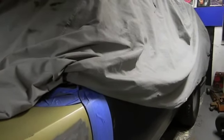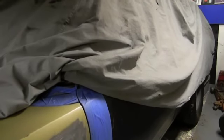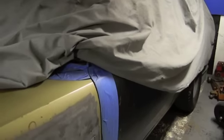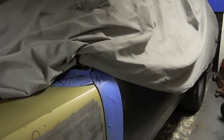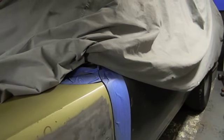You can mount it off a bracket, but I still have to open up the tailgate on this thing. I'm thinking across the gate on this car — it's a Rambler American — popping that back off and actually using the molding holes to hold it there so I don't alter the gate in any way, and then tying the two frame rails together behind the bumper with an angle plate.